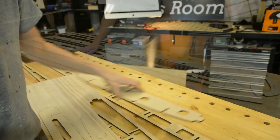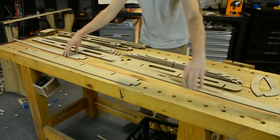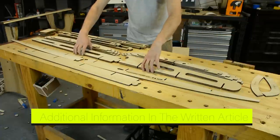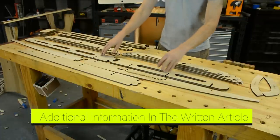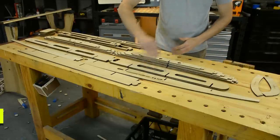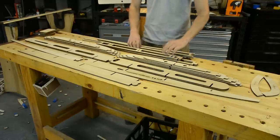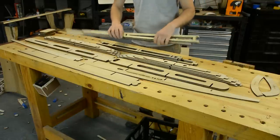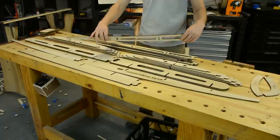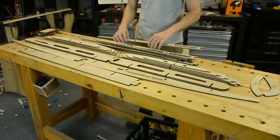Our kits are all broken up into basically three components. We've got our spines — on an SUP we have our center spine as well as our side spines. On top of the spines we have our ribs, which are the pieces that run across the board and give it its width as well as its shape. The last component are the rails, which look a little bit like the spine but are a lot thinner and have relief all the way through.